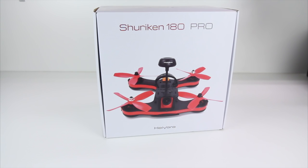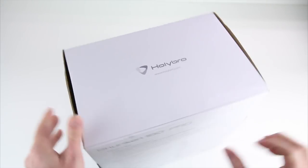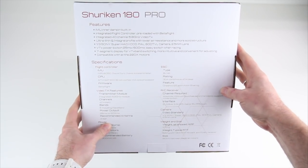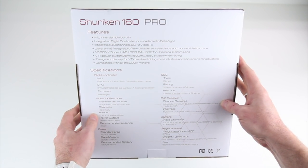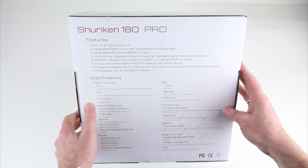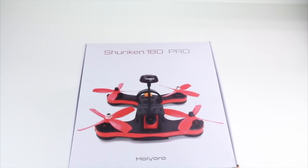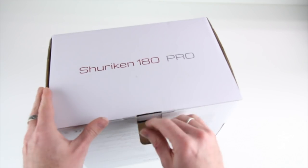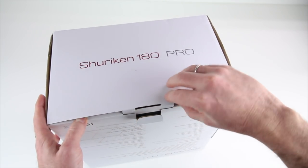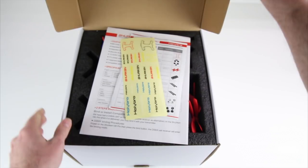There's another video on the channel as well — make a comment on that one too, so I'll be drawing from both videos for the Shuriken 180 Pro. Let's open up the box first and show you what comes with this new model from Hollybro. This is a 40-channel 5.8 GHz video transmitter with five different switchable bands, and it's also switchable between 25 milliwatt and 600 milliwatt. I wish they'd done 200 — Hollybro, if you're listening, 200 is pretty much the standard for racing. 25mW is great close up, but 600 is too much when you have other guys around.